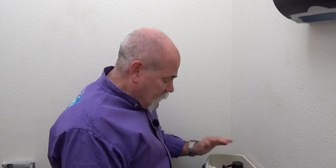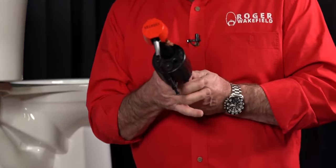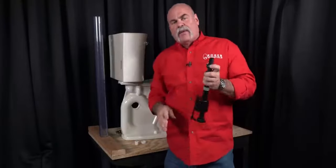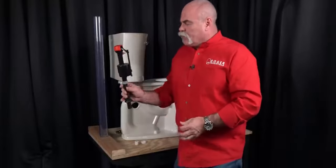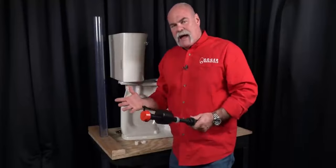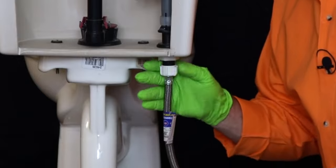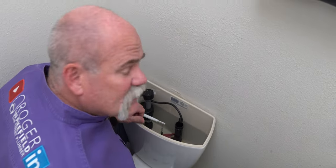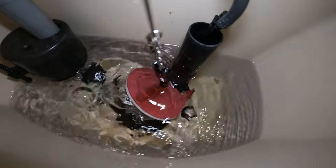The two pieces that normally have to be replaced in a toilet if there's a problem are the fill valve and the flapper. The fill valve is very easy to do — we've made another video about it. When replacing the fill valve, put it back at the right height and make sure you've got the old and new ones set at the same height. Turn the angle stop off, disconnect the supply line, disconnect the nut, and pull it out — this whole piece is very easy to replace. The flapper is also something you can do yourself. To be honest, there's nothing in here you can't replace yourself if you'll just get in and try. Just do it — it's going to save you money from calling a plumber.